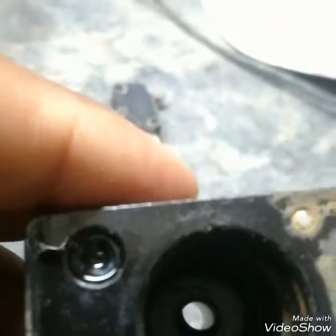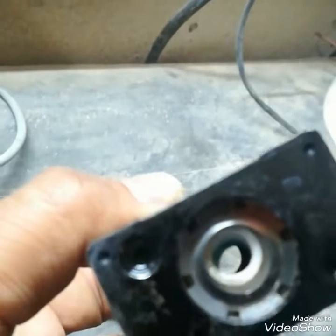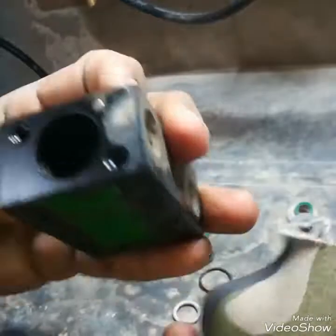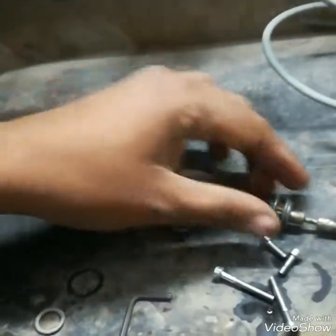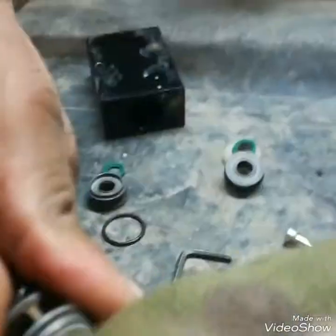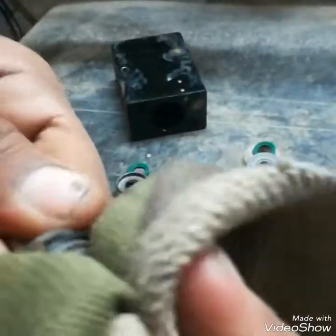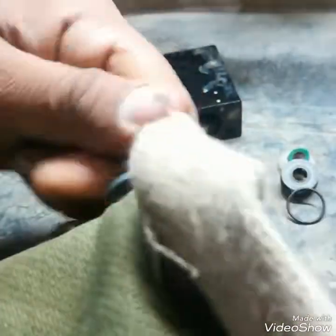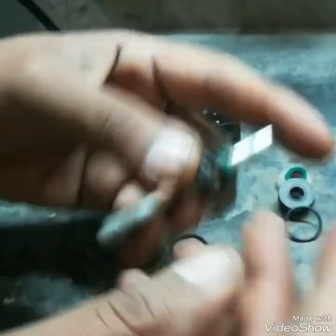After properly cleaning the body, cleaning the plunger, and applying a little grease, this SOV will work very well. You can see there are many o-rings — these o-rings may be damaged due to moisture and rust. The plunger needs to be cleaned. When you open the SOV, check the plunger, the body surface (it should be smooth and undamaged), and verify the o-rings are OK with no moisture.